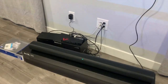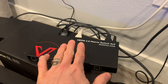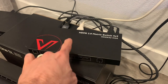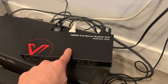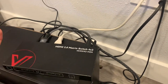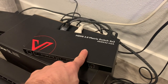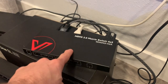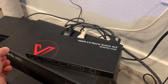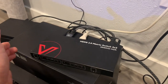Hopefully this is helpful. I'll put a link below. I looked at multiple different matrix switches and purchased a $50 one, a $90 one, and a $450 box, and I ended up going with the $90 box. You probably don't need four inputs, but I wanted to make sure I had enough. The most important thing was finding something compatible with ARC — the Audio Return Channel — and having some adjustment options for it.